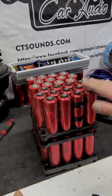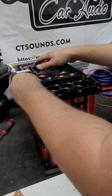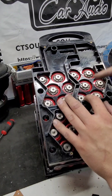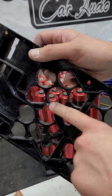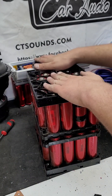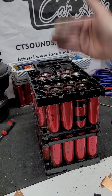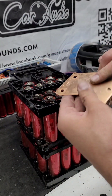Now that we're upside down we can see where we're at. Once you put this back on like this, very carefully — look at that. So now the way this is set up: negative, positive — all this is positive. What I'm going to do is cut a little slit out right here so my little jumper bar can go across. I basically cut a little notch right here — it's kind of ugly but it'll work. Then I'm going to cut these bars off flush with the top right here. When we reassemble them we'll have a positive side and a negative side. I cut these two little bars — all I did was cut the little tops off of them, so now they're ready to go back on.